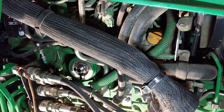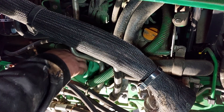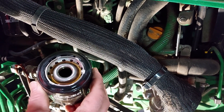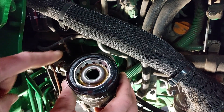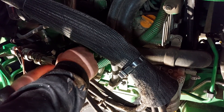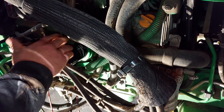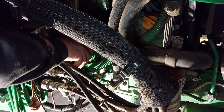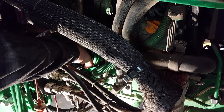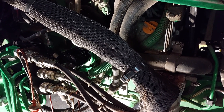All the black oil is drained out, now it's time to put in some fresh oil. We're going to wipe off the filter housing real good. We did pour a little bit of oil in the filter to help it not run too dry for too long, and got the gasket nice and lubed up with new oil. The filter is black - I prefer white ones so you can write the date and engine hours on it when you last changed your oil. Be sure to write it down in your service record.